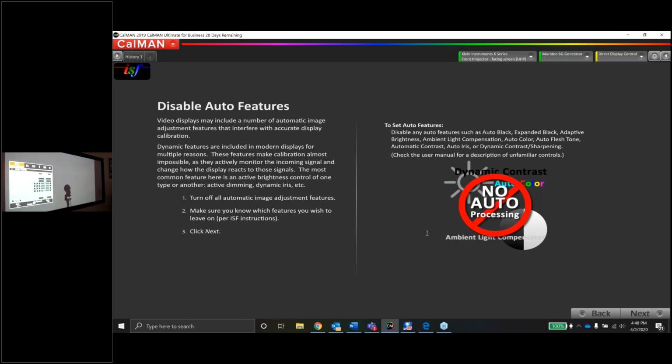So the color profile is, let's actually reset that. Okay, so the color profile standard. The color temp, 6500K. We've got the gamma. MPC level, let's go ahead and make sure all this is turned off. The 4K E shift, unless somebody has any objections to this, I think we can leave that on to do the calibration. I don't see why not. Let's see here. What else do we got? Original resolution is auto. That's fine. Blur reduction and things like that. That's off, off, off. Great. And then we just have contrast, brightness, color, tint.